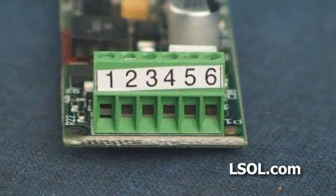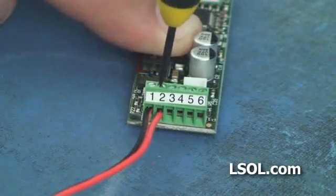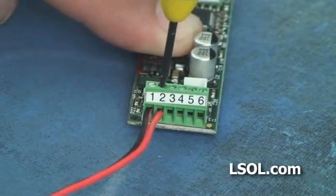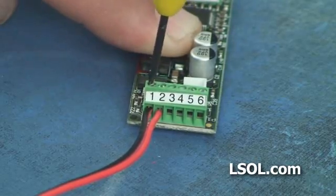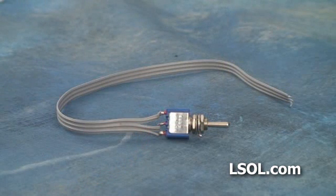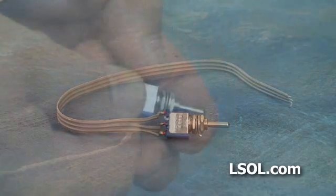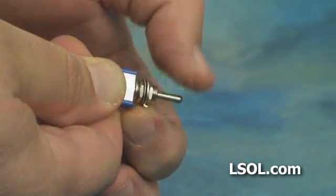There are five different connectors located on the board. We'll take a look at the first one that's labeled 1 through 6. You will use ports 1 and 2 to put your wires that go to the controller. The controller can hook up to a battery or a power supply, but these should be the wires that have the same voltage that is varying to control the speed of your engine. There is also a volume switch — a momentary toggle switch that goes in two directions: one for increasing the volume, the other for reducing the volume.